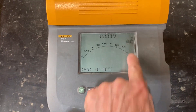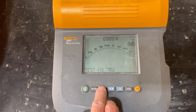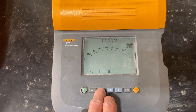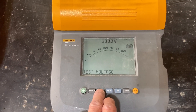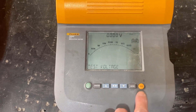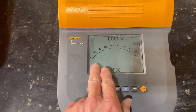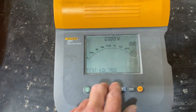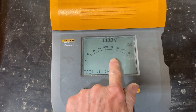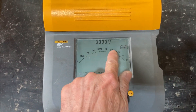Here's a flashing voltage right there, and to navigate the voltages up and down you just hit that button. You can see it's moving and now it's at its highest setting of 5,000 volts. When you do the test you just push this button right here and it'll do its testing — it'll display the voltage that you're testing at and give you the readout of the resistance reading, and you can see it moving on the scale.